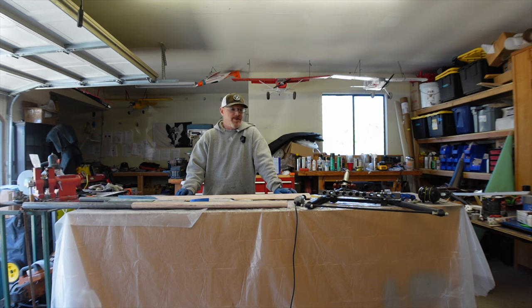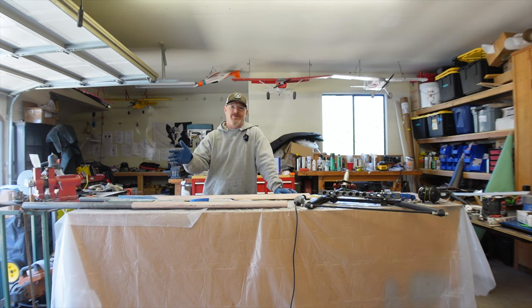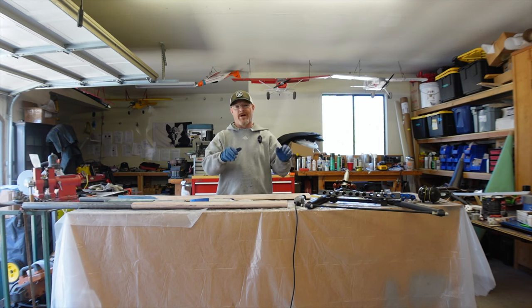We're doing the Shock Monster landing gear leg fairings and covering, and I hope to attain 100 miles an hour cruise speed when I put this gear back on. So with the fairings on the wing struts and the Grove gear that we have on there with the shock wheel, I'm somewhere in the 108 mile per hour range. So if I pull that off and these are faired and I put them back on and I only lose about 8 miles per hour, I can maintain that 100.